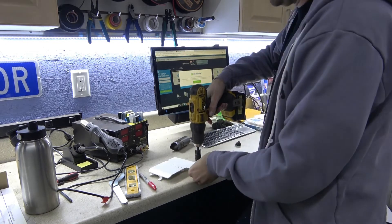My lowest heat setting is 62 degrees, and taking 22 degrees off brings me down to 40 — above freezing and exactly where I want the garage when I'm not here. The AC will think it's 62, heat the room to 40, then shut off — exactly what I'm looking for. Now I'm going to install it permanently with a summer/winter switch, so in summer it reverts to accurate temperature reading, since the AC range is fine for summer cooling.